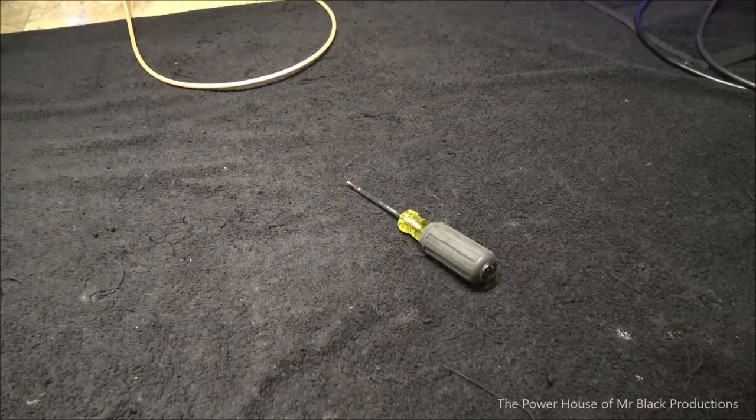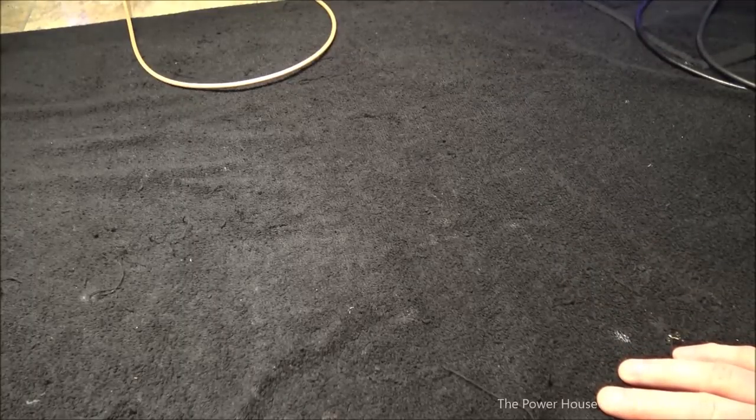My 756 Pro II was Mars modded. And so I tried all kinds of different stuff. And what I finally figured out is that the radio goes into infinite attenuation and it totally isolates out the receiver side if it isn't Mars modded and you just put the radio into transmit. So what we're going to build is a two-stage Dow-key.